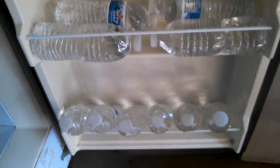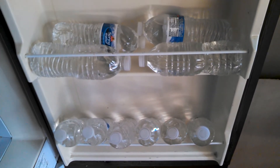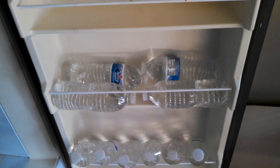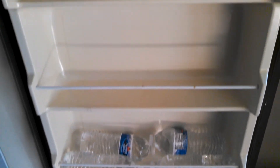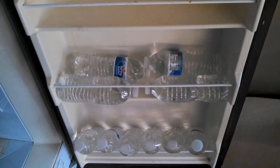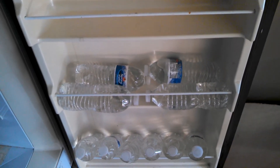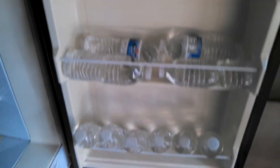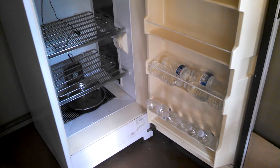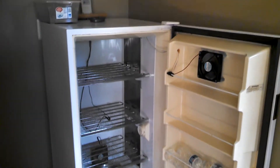I got the old water bottles in there. The reason you do that is when you're opening and closing the incubator, those water bottles are still heated up to the temperature it was, and it goes right back up to temperature. Or if you got a power outage or something, that'll keep it warm in there while the electric's out.